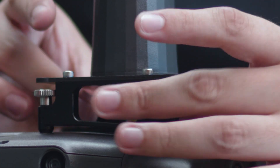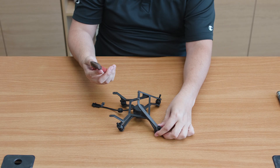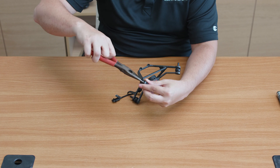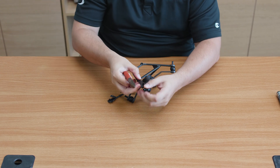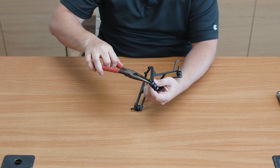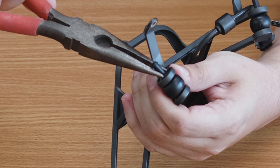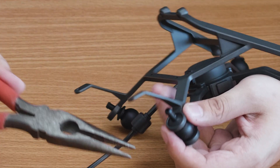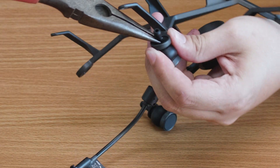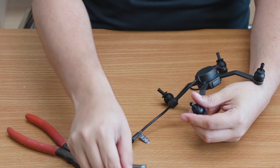Installation is simple — it just requires you to tighten the four thumb screws into the proper spot on top of the M300. Next, we need to upgrade the M300 with our integration kit. This kit enables the M300 to properly carry the Recon payload while making sure harmonic vibrations don't affect the sensor. This upgrade is a little more complicated, but still very simple to get installed. Remove the vibration isolators from the original mount and install the upgrades in each proper place.